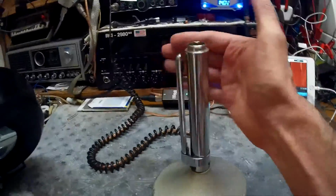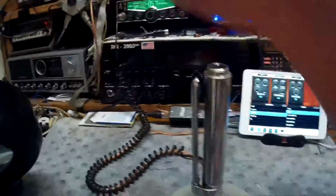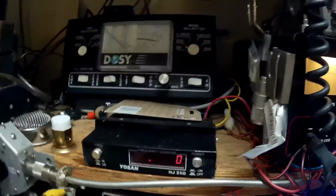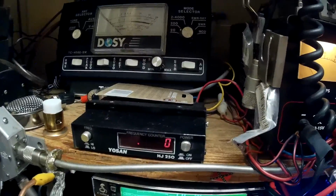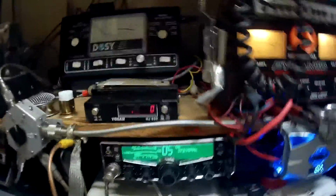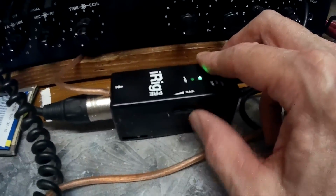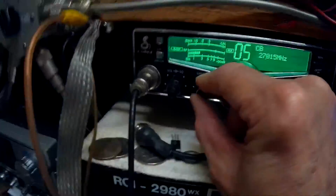But here we go. Okay, I use my D104 to key up the microphone. No head, and this is what it's running through right here. I'm on a 20 watt scale. Like I said, I got that modulator running a couple watts. The way I've got it, there's an adjustment on the side, a gain control on the side of this thing. You can increase or decrease your gain. It helps you fine tune everything a little bit, because you can't turn this up at all.